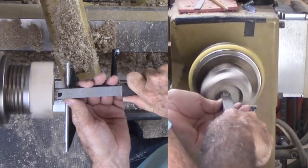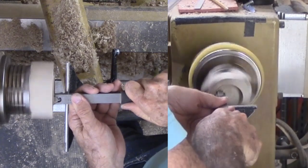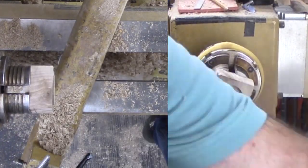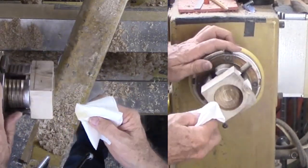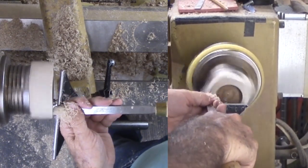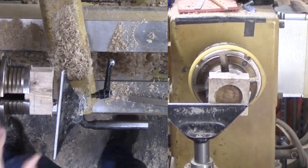After sanding, I am using a rotary texturing tool to add a pattern to the inside of the lid. Different radii yield different patterns — there is an inner and outer pattern. Then I touch again with fine sandpaper before applying shellac friction polish. Perhaps I should have done this before applying any finish, but better late than never. With a scraper, I clean up the rim outside the center hollow, then sand and finish.